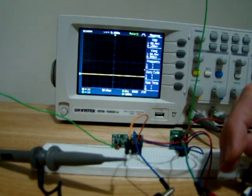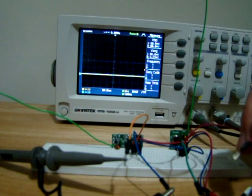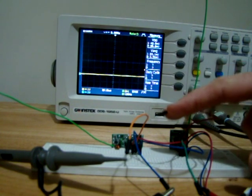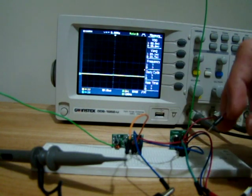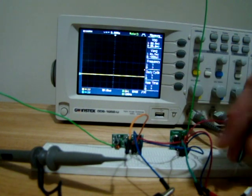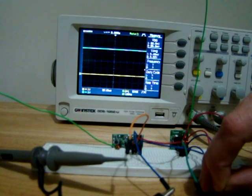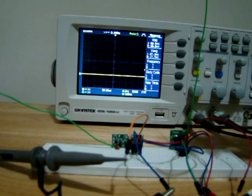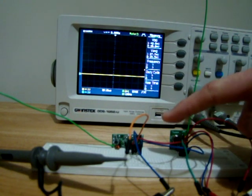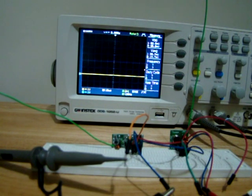So what that tells us is, I'd say it's probably the receiver more than the transmitter. So we'll say the receiver is just outputting a pulse when it receives the waveform, because I'm pretty sure there's nothing in this transmitter, so it's probably just constantly transmitting a pulse, even though our receiver only outputs and goes off. I think the signal from the transmitter is constantly pulsing, but we have a kind of a set pulse length on the receiver. So that maybe is making things a little bit tricky for us to try and get it perfectly set up with the serial of our Arduino.